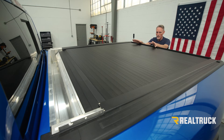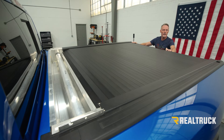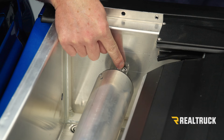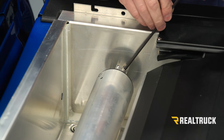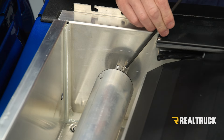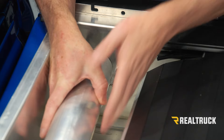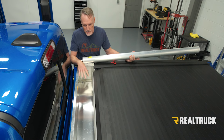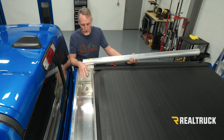Now that we've removed all the rivets that hold the cover to the reel — mine still had spring tension so it undid itself — we're going to pull back on the cover just a little bit to free up that reel and remove it from the canister. We're going to go to the end of the reel where there's an Allen head bolt that needs to come out. Use a nice extra long 3/16ths Allen wrench to unscrew it. That frees up the reel so we can raise it and slide it out of the canister. I've also gone ahead and cleaned out any metal shavings from inside the canister — it's very important to do that before going further so nothing gets caught and damages the cover.